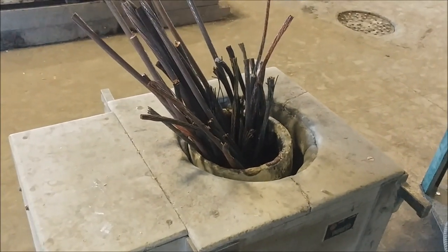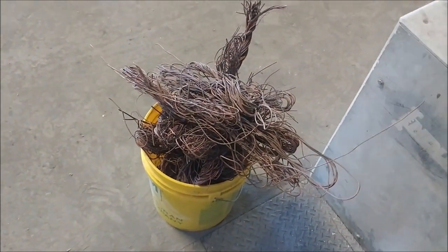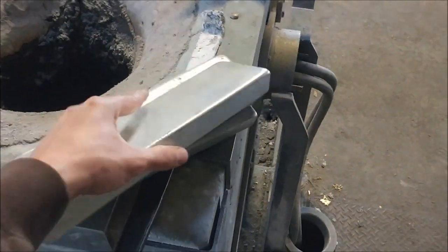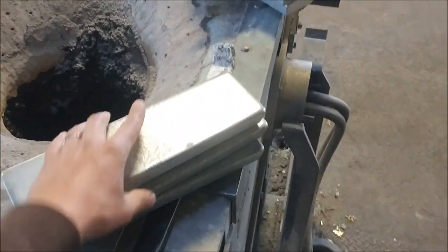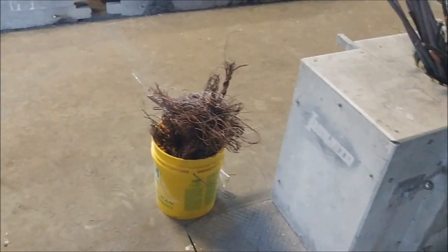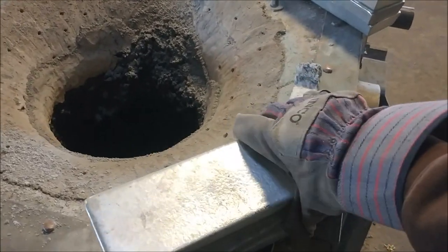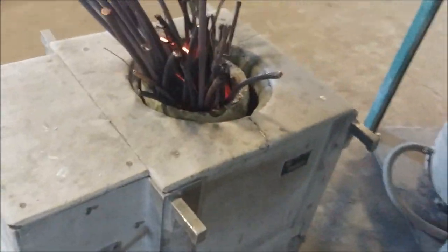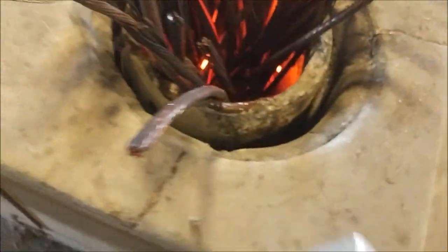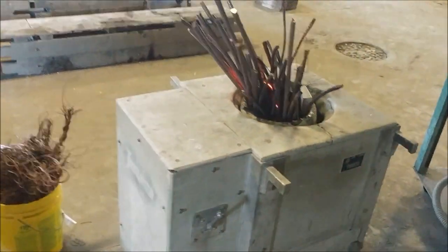You can see here we got our pot starting to heat up, we got our copper cables in there, and here in this yellow bucket we also have a little bit of extra copper. All together we have about 100 pounds of copper, and over here we have our zinc ingots that we made. We're going to be adding about 75 to 80 pounds of zinc. We got our copper warmed up a little bit — the zinc has a really low melting point, so I like to get the copper warmed up a little bit first — and we're adding in our zinc now.